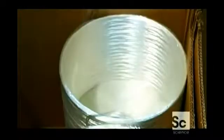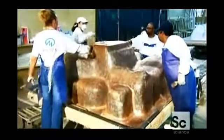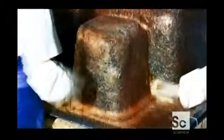Back in the hot tub department, it's time for a base coat. They spray resin on the shell, and then unwind fiberglass twine into a special spray gun. It chops up the twine and mixes it with more resin to give the shell a fiberglass coating that reinforces the acrylic. They press out any air pockets in the fiberglass.